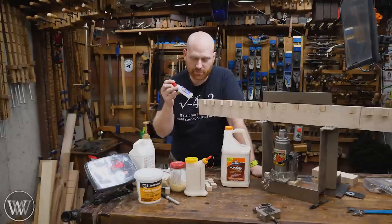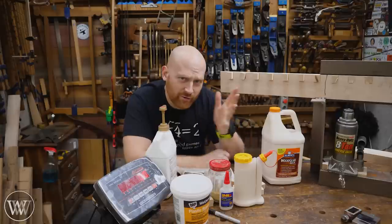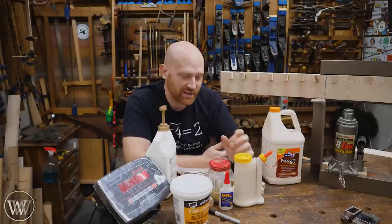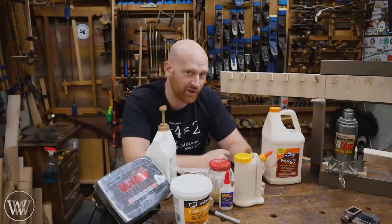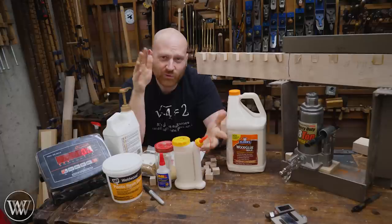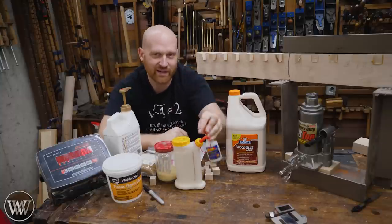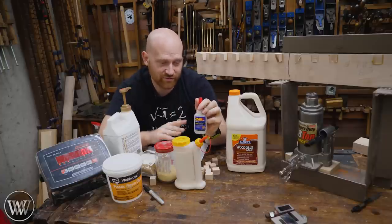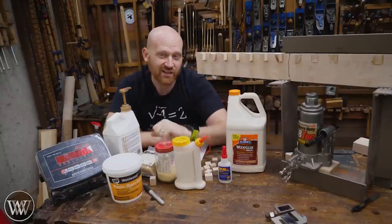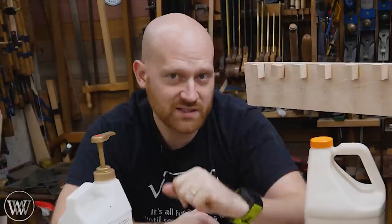With the exception of the 2P10 superglue — a quick bond works well, but after about a year or so it becomes so brittle that it will actually fail long before the wood does. One of the big purposes of the test was to determine when I should use particular glues, because I use a collection of different glues for different purposes — they each have pros and cons, and no one of them is better than any other. With the long-term test it's been really fascinating to see how they're pretty well standard — there's some variation, but it's mostly within the variability of the test. It's an incredibly strong glue right off the bat, but over time it gets brittle and the expansion and contraction of the wood, even on small scales like these little blocks, can cause it to fail. I'm interested to see if the West System Epoxy continues to climb and if the hide glues continue to decline.